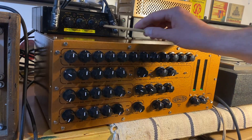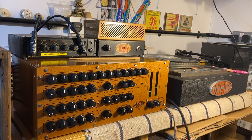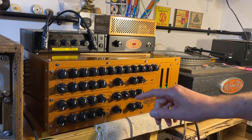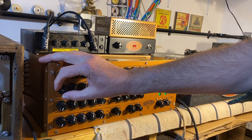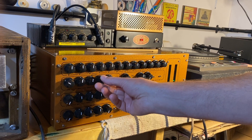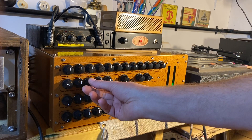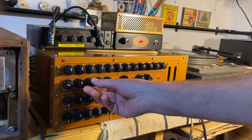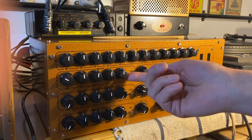If I try the mic — I think I've got the mic plugged in here. Check, one, two, mic. Right, I'm on the microphone now. If I flip this down here we'll get an echo. When I flip it up, it's stopped. And it's the same with the music on the music channel. So that's the amount of echo — we've just got it halfway. This is the gain for the microphone. We've got bass, mid, and top — which is very strong. That's a lot of top, that's a lot of mid, and that's a lot of bass. So on the microphone channel we've got a little bit of bass, mid, and top EQ. The mid's quite important on the mic — it tends to cut the mix when you've got less bass and more mid. So that's the microphone channel, and we can send it to the echo unit and do outer space effects.